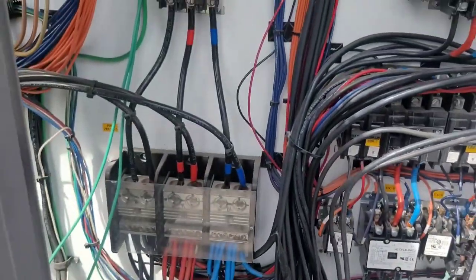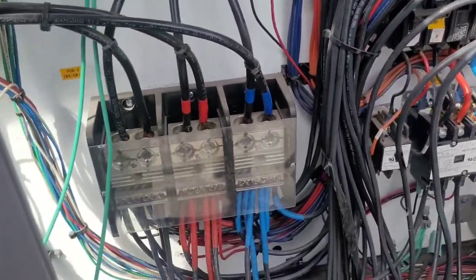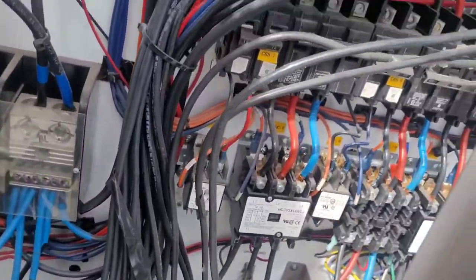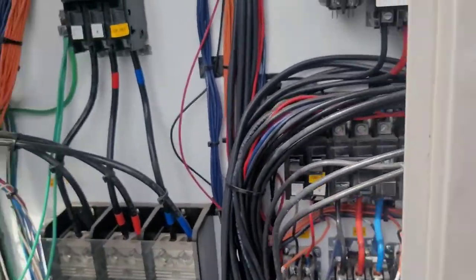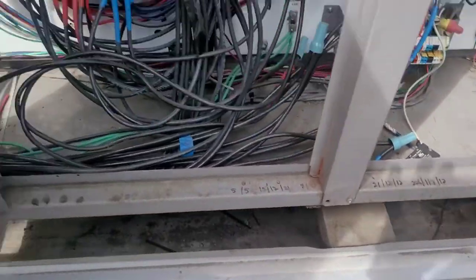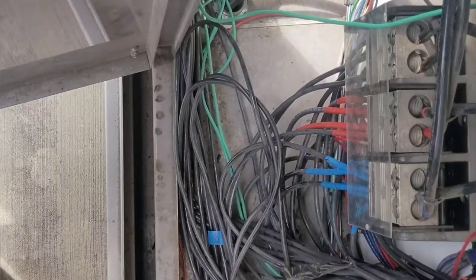It's a 60 amp three phase breaker and it's 480 3-phase power, and we're going to have to change it while there is live power here. So that's a little tricky — you always want to be careful with that. I've gotten lucky in that I've never been shocked or hit by anything with serious current going through it, so I've been quite lucky in my life, and I want to keep it that way.